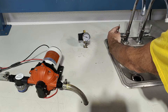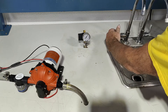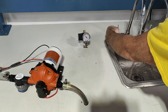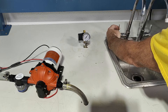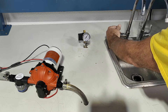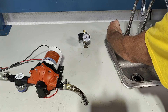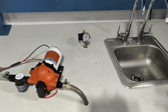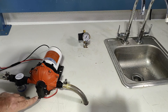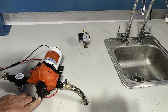All the way down to a trickle. Open the faucet, full flow, all the way down to a trickle. Even at the smallest possible flow, we're still not cycling. If the pump were to cycle at low flow, it has an adjustable bypass screw right here that you can adjust with a two millimeter Allen screw.